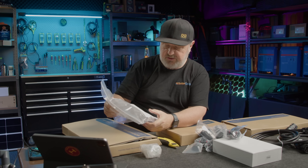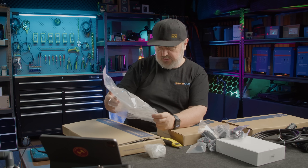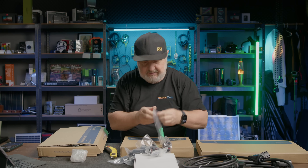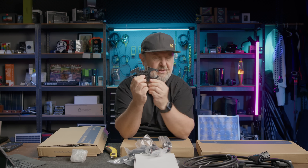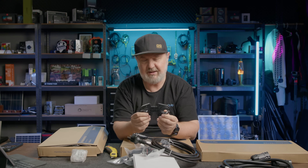Connectors, lots of them. End caps, ceiling caps, disconnecting tool, trunking connector, extension connector. This here is the tool you require for disconnecting these from each other. That's why it's relatively safe — you can't unplug it under load without using a tool like this.